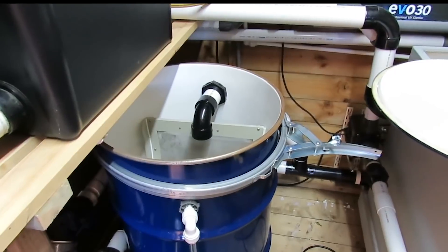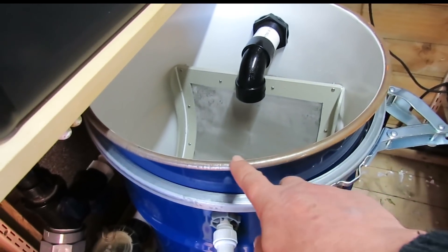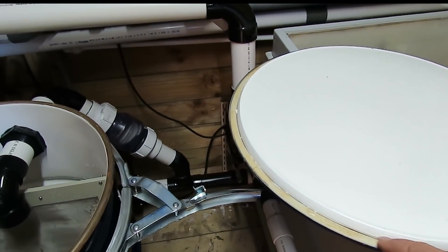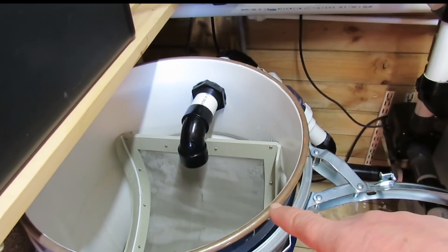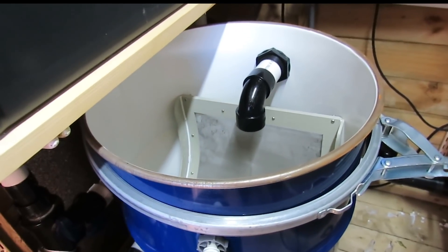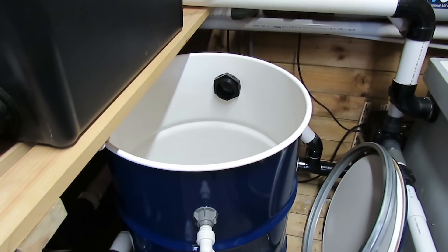The pre-pump filter has been running really well — I'm well pleased with it. The problem I've got is I left this edge because I didn't want to interfere with the seal on the lid. I didn't think we'd get any water up here, but when you take the lid off the condensation runs into the seal, and when you put it back on the seal wets it open. As you can see, we're getting slight traces of red rust. So I'm going to rub this down and give it a coat of pond paint around that rim, just to make sure we don't get any more rust.